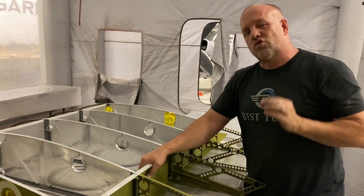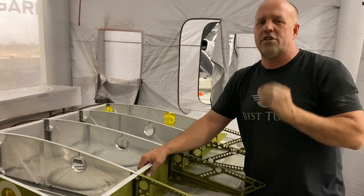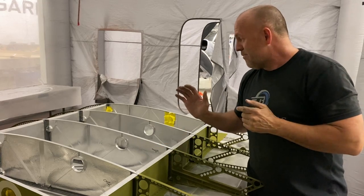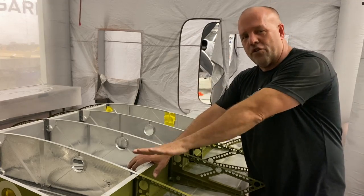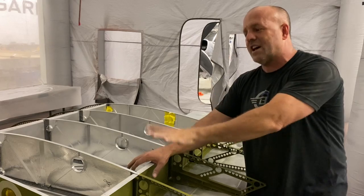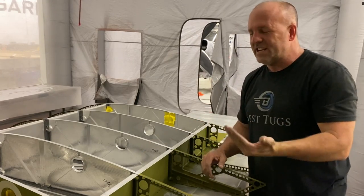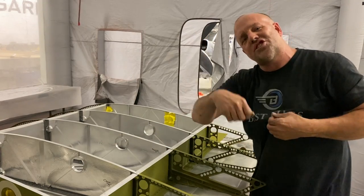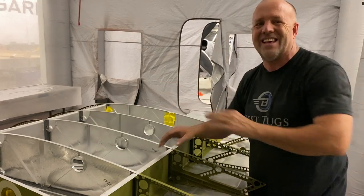Then after that, there's one more layer of tank sealer, and it's a little bit controversial. No, it's not at all what you think. I'm going to prep to put it in, but really I've got two barriers for fuel protection right now, and that has been used for a long time and worked great. Sometimes, and back in a lot of Citation jets, after this area was done, they would brush a tank sealer on all of the aluminum walls and skins.